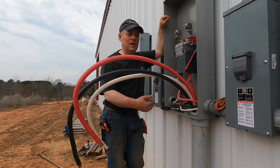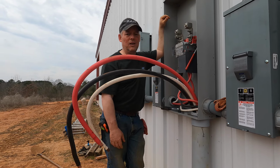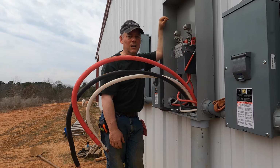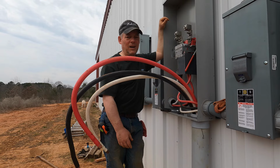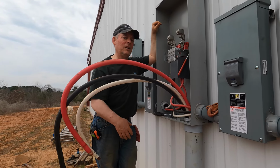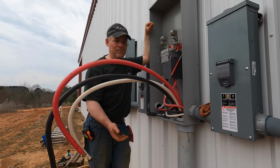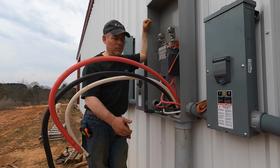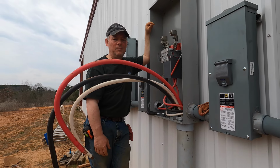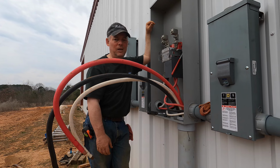Then I ran a sewer clean out deal, big giant electric snake down into it, and we hit basically a mud wall. And so that told me, okay, I got a problem with the pipe. So then I dug it up again. And of course, in the process of digging it up, I actually hit the pipe and broke more pipe. And then we dug by hand for a whole day. Pretty much I dug by hand, got down, and I found where the pipe was separated.